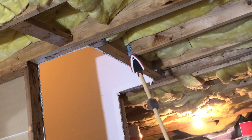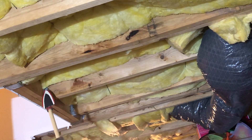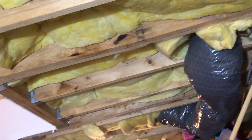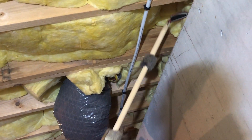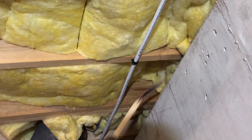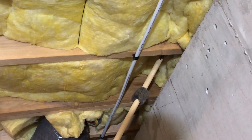This single joist hanger is connected to our cripple joist. This cripple joist is fastened from our header joist out to our sill plate. Then if we remove the insulation out here, we have another joist going this way called our header joist or box sill — that's where these 2x10 floor joists are fastened to.